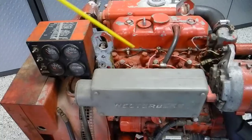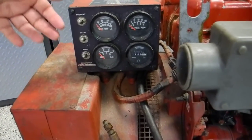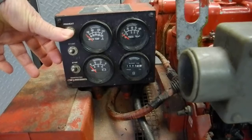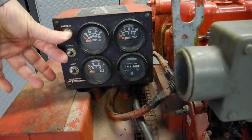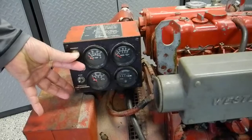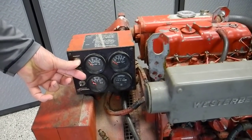To activate this, you'll need to go to your starting panel, either on the generator or on the wall in the cabin of the boat. Press the preheat and depending on how cold it is outside — if it's snowing it's very cold, or if you're in Florida where we are, it's not that cold — preheat it for five to thirty seconds, whatever is enough to heat up that air. Then press the next button down and start the engine.